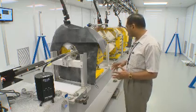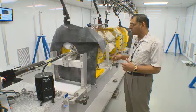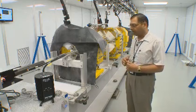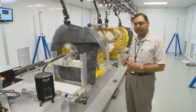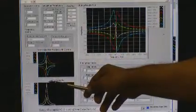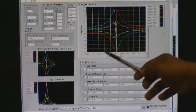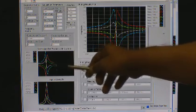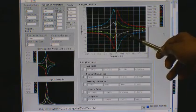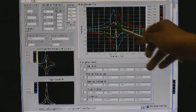The idea is that if the magnets did not move during this ride, then we will find them to be still aligned to the wire. We just finished measuring these magnets with the wire again and the results came out incredibly good. The magnet vertical profile — the magnetic centers in the vertical axis — are within one micron of what they were when this girder left this room.